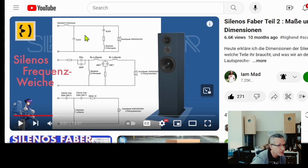So here we have a woofer, and as you see in this crossover, there's an inductor and a capacitor. So it means this is a second order low pass filter. And then look at that, there's a filter there with a capacitor, a resistor, and an inductor. So that's like a leveling filter, a notch filter there to adjust part of the driver's output, so it's doing leveling and also some impedance correction as well.